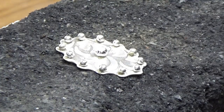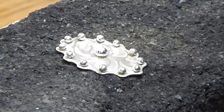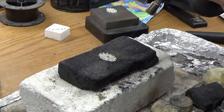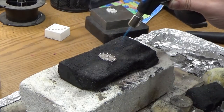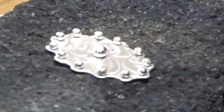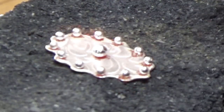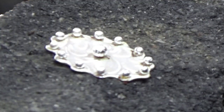Okay, this is the easy part. Strike your torch on — I'm just using a little butane torch. I'm going to start a little ways back so you can see how far away I am — just a few inches — and I'm just going to warm the plate up a little bit as I move in closer. What's going to happen with this paste solder is it will burn off the organic compound that binds the flux and solder together. Then I'm going to move in a little bit closer, and you're going to see those little balls just set themselves right into the little divots. Watch your metal — as soon as it starts to turn pink, by the way this is medium paste solder, you want to back it off.